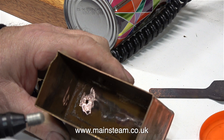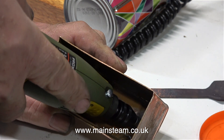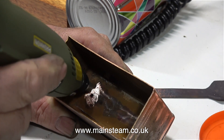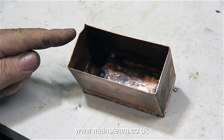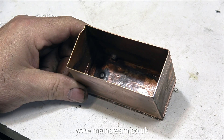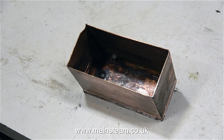The original mounting of this tank was a bit mad really, as the tank was screwed to the baseboard using some steel wood screws and a piece of rubber sheet as a gasket. To clean up the copper around these holes, I'm using a diamond burr, which is one of a set sent to me by a man called Martin — and I'd like to thank Martin for those; perfect for doing this job. In case you're wondering about this dinted part — why is it like this? It's to allow the tank to be fitted right up close to the boiler casing; you'll see it better when I come to fit the tank. I've soldered a couple of 6BA bolts into the holes in the bottom of the tank, obviously to plug up the holes and to mount the tank to the baseboard. I'll show you how I do that when I actually fit the tank.